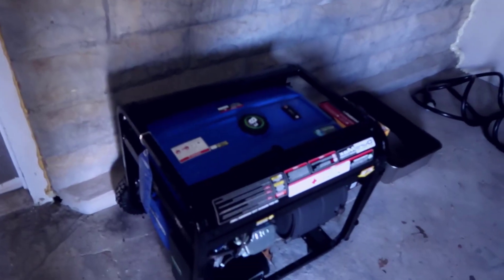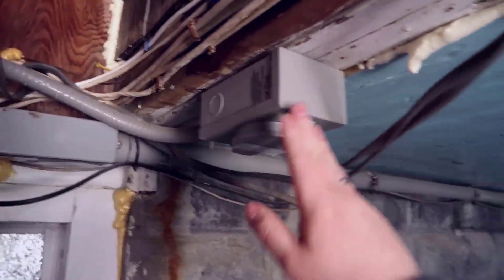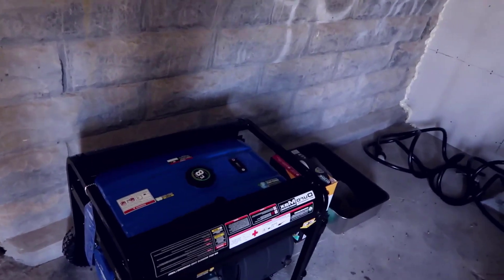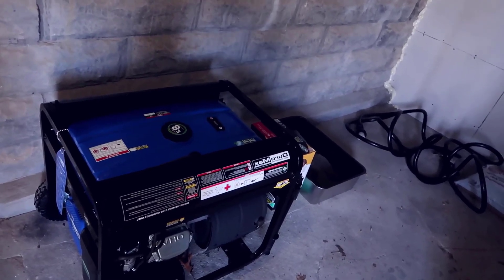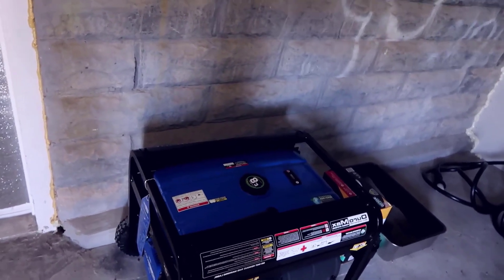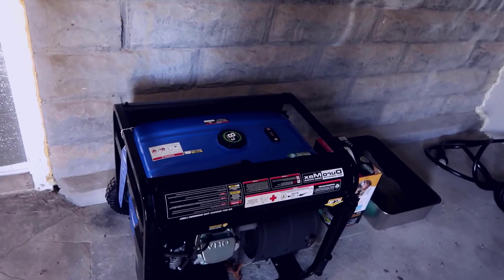Ultimately I think this is a great combination if you're looking for a starter setup that gives you future-proofing. Get a standby generator, have your electrician wire up the 50 amp. This cable is a 30-footer and it legitimately reaches all the way out back, so make sure you have enough length to run the generator at a distance. During a power outage, just run out to the Generac box, flip the manual switch. When power comes back, power down the generator and flip the breaker back up. I recommend this as a good entry-level starter package, eventually upgrading to the larger Generac generator when you have the funds. Thanks for watching!